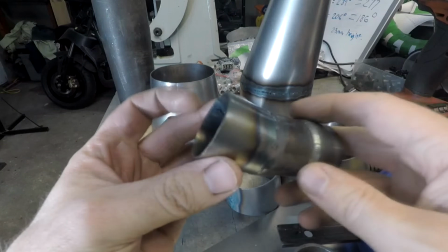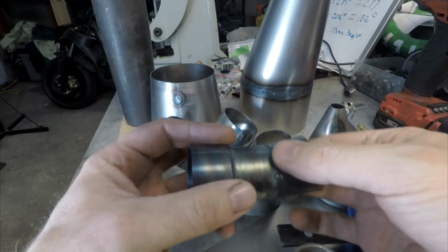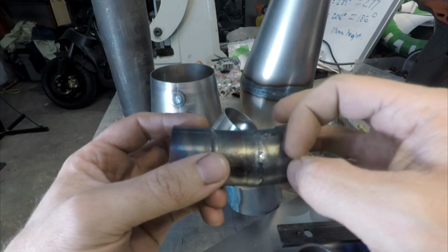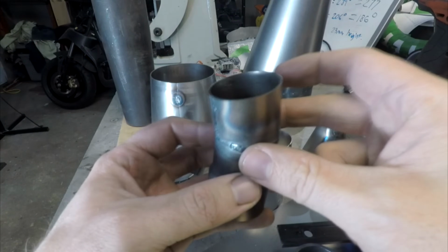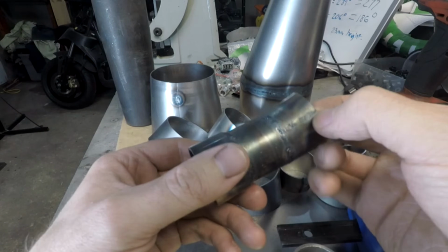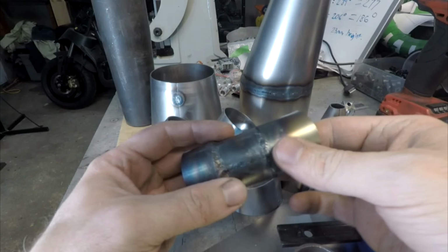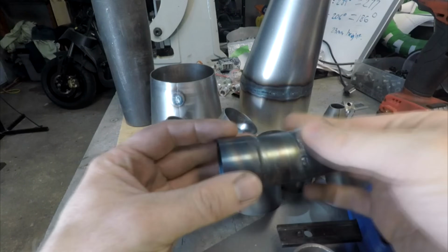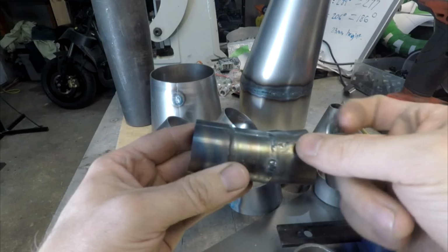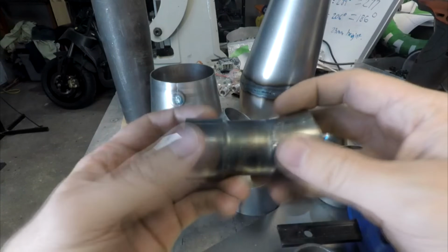Just try and get it as big as possible. The other thing, it acts as a heat sink, so it keeps you from blowing away accidentally. I have pulse on my TIG, so it's easy to set up to go very gently, and then as you get to the edges, feather out so that you don't blow through. But if you're using something else that doesn't have pulse, put a heat sink underneath it, and it'll help with A, blowing out around the edges, and B, keeping inclusions from forming on the inside.